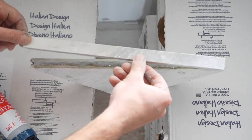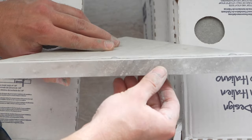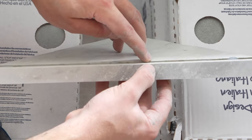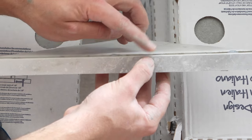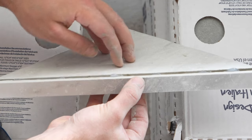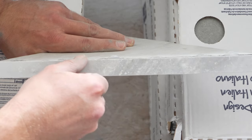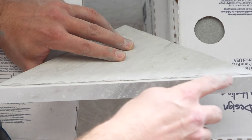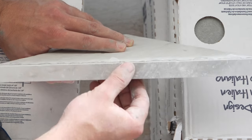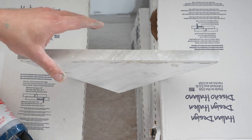I'm going to lay the face right where I want to install it and make sure the top of the face is dropped down below the shelf edge just a little bit — you don't want water collecting there. If it's up high, water will settle right there; if it's down lower it will run over and down to the drain. So you want it flush or a little bit below. I'll wiggle it right into place. All the caulk that pushes up through — don't worry about wiping it off now, because after it sets up I'll just take a razor knife and cut it off. Let it sit and cure for at least 12 to 24 hours, preferably 24.